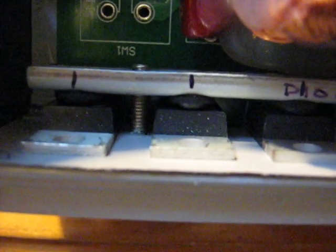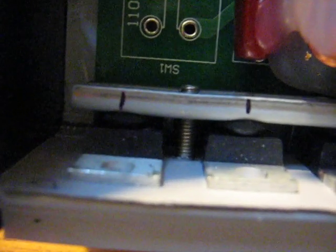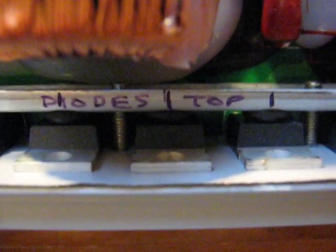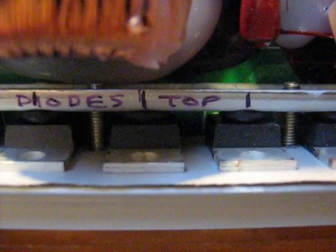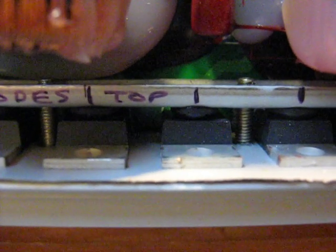The other thing I did was fitted in between the batten, which is the metal bar there, and the diodes and the MOSFETs on the other side — I fitted these little rubber feet. You can just see them; they're little rubber domes. And what that does is it individually spring loads the diodes against the heatsink. Because the batten's not terribly straight, and because the diodes are all slightly different sizes, it's impossible to get even pressure without these little rubber feet.